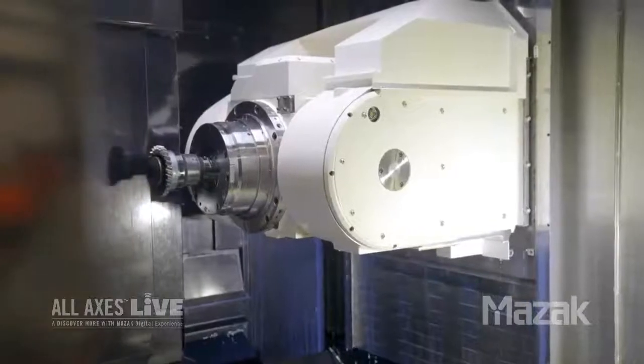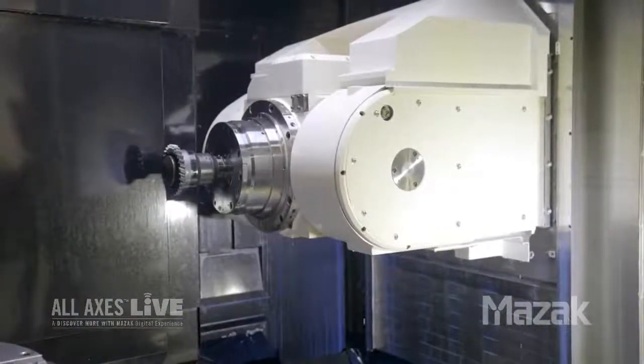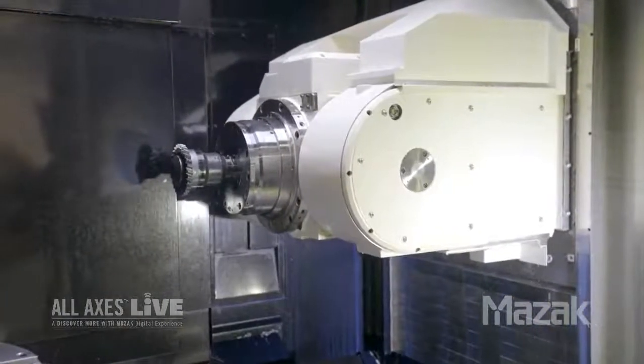This enhances the ability to efficiently cut gears without sacrificing versatility. One of the main features on this machine is the tilting spindle head. This is one of the key elements allowing this machine to cut a wide variety of OD and ID gears such as helical, spur, splines, and straight or spiral bevel gears.